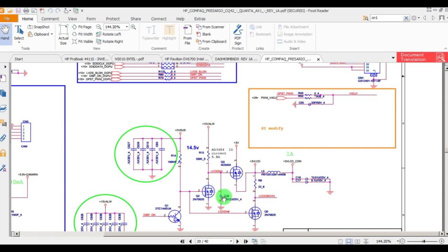I don't want to replace it immediately — first I will just pull out this capacitor to check for a little time whether the full voltage transfers from pin 3 to pin 1. If the voltage is fixed, then I will replace this capacitor for circuit accuracy. Let's remove this capacitor first and check if the problem is solved or not.